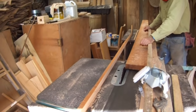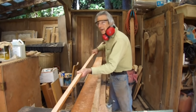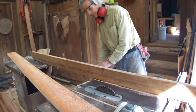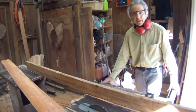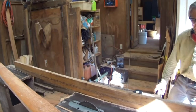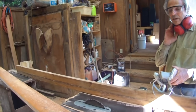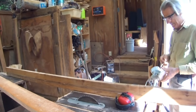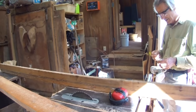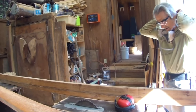It wasn't quite straight before, so it'll be straightened out on the other side. When you have to bend the board as you nail it down on the deck, it's always resisting that, and eventually it pulls itself back to where it wants to be — especially a pretty big board like this. The goal is to straighten it as much as possible so it doesn't pull the nails out of the deck.